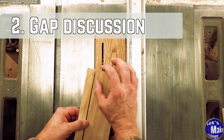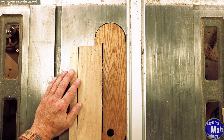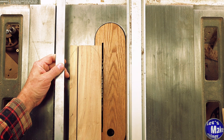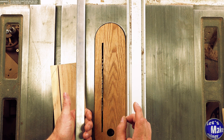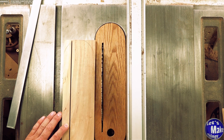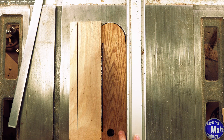At this point you'll want to add something to fill the gap. What's nice is you don't have to remove your riving knife to do this — you just add that piece afterward, which isn't really a problem. For someone like me without a riving knife, I'm going to use a piece of steel on the end to act as a splitter. I've got 12-gauge steel here, which is the exact thickness of my blade — a 3/32-inch blade.